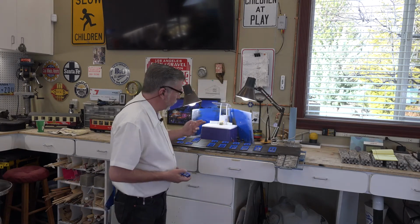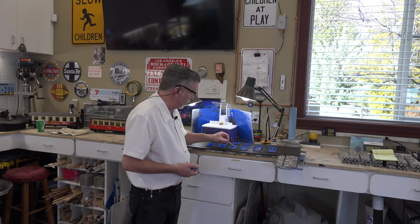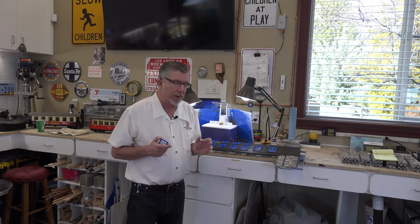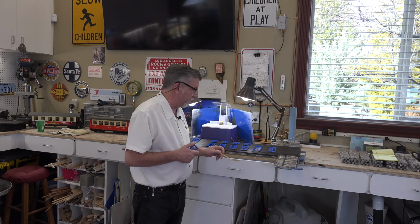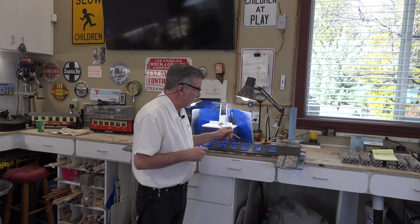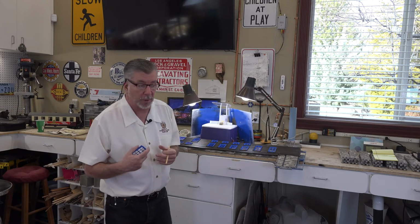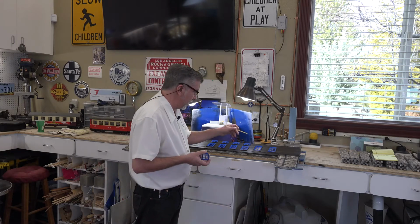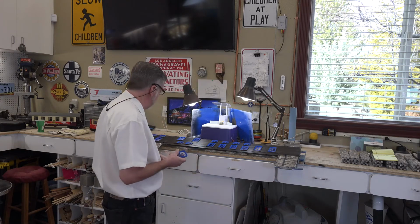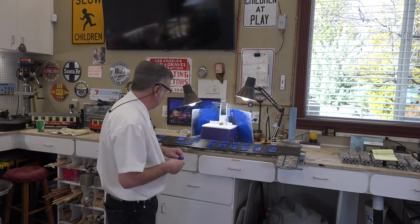And then I used a wood glue, an exterior wood glue, to attach these. Really important to stain everything first, including your little trim pieces, and then glue them on. As if you glue them on and then do the stain, the glue sometimes will block that stain, so you'll get more of a discoloration. So stain everything and then glue it together.